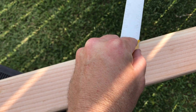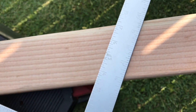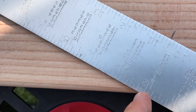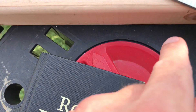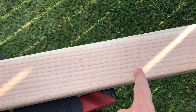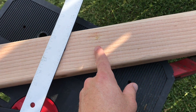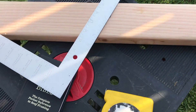Your first mark is going to be right here. I'm going to cut the video for a second because I'm holding the camera in one hand. Okay, so I made my marks. Plumb cut right here, I got it marked. For the end, you can mark it in two different spots. I like to do it this way — the 12's here — and then just go up on your square to the mark that lines up with the 12 and put a mark. Or you can mark at the bottom on the 12, but I'm going to use this mark here.